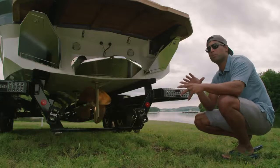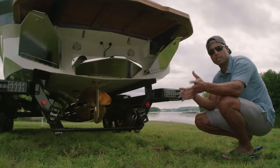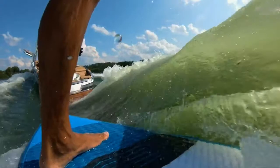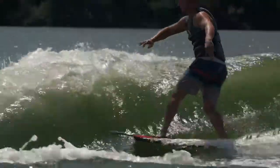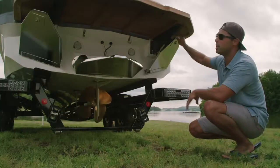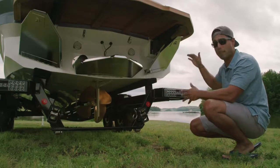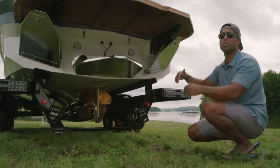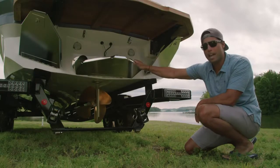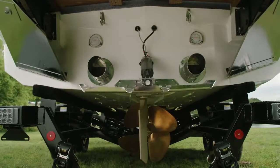When you're talking about a surf system, regardless of manufacturer, you've got a few variables you're trying to control and manipulate to get the best experience possible. One would be some sort of surf device, two would be your ballast, and three would be speed. With the Gen 2 surf system, you've got a starboard device and a port device. If you're surfing on the port side, you deploy the device on the opposite side — the starboard side — and vice versa. We also use the attitude adjustment plate or the center tab to help mellow the transition and clean up the top lift.